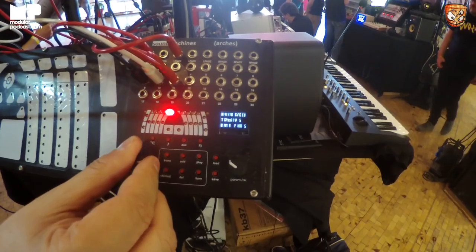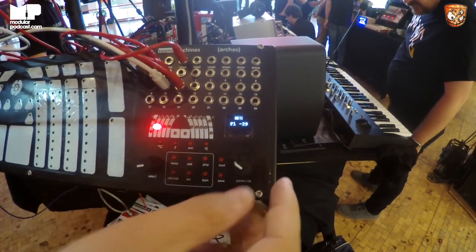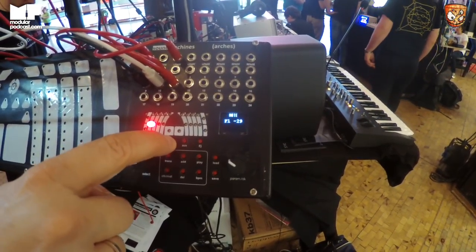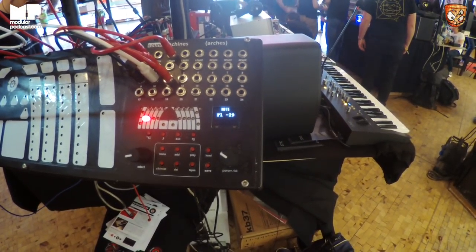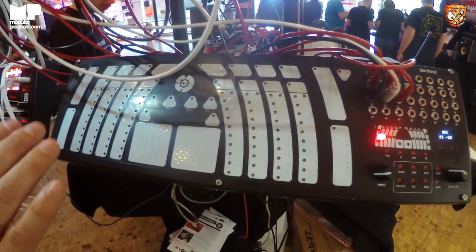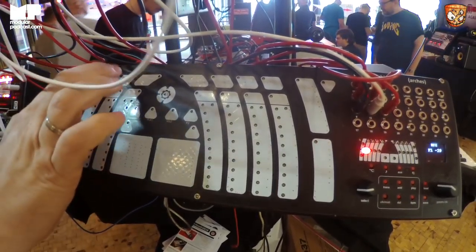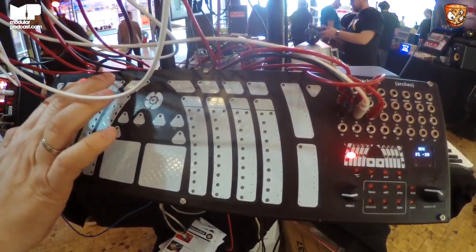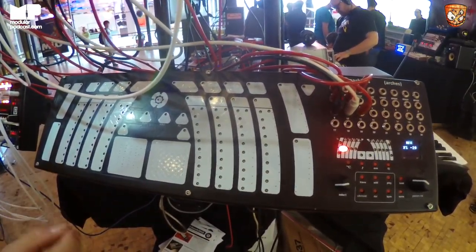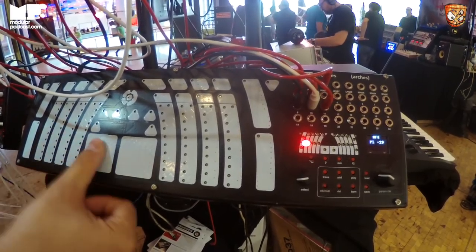You just select the element, and you select the MIDI note, the channel, and also the standard that will have the output. For each keyboard, you will normally have three outputs. You have a gate, a pitch information, and obviously an expression information. For this one, it will be the position of your finger on the strip. For this other one here, it will be the pressure of your finger on the button, because it's pressure sensitive. Here you have X, Y, and also Z, because this one is also pressure sensitive.